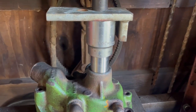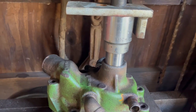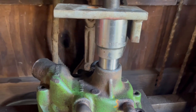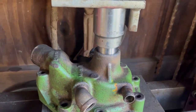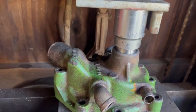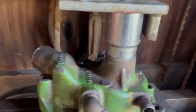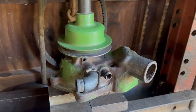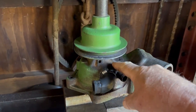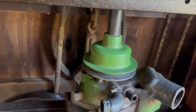I'm using this three-quarter inch drive socket to press this in because I want to be pressing on the bearing race and not the shaft. It seems to be pressing in in pretty good order here on my press. I've got a piece of quarter inch steel underneath there up against the shaft, so I'm only pressing on the shaft and not any of the housing. The shaft is taking all the pressure, so I get this pressed down until it's flush, and then the jack should stop.